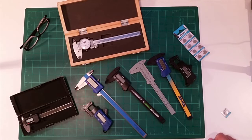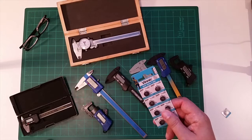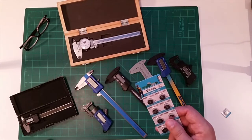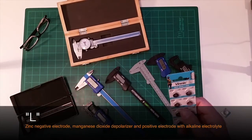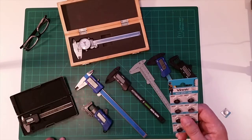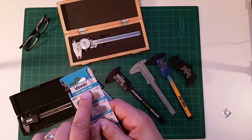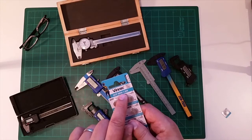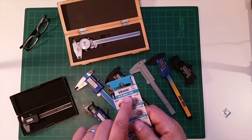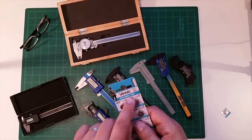I tried a different one — didn't work either. So I did a little research online, and there is a vast difference between the SR-44 and the LR-44. The 'L' in LR-44 stands for something related to alkaline — I'll put the Wikipedia link below. Long story short, they're an alkaline battery with a voltage of 1.5 volts. The SR-44, by contrast, has a voltage of 1.55 volts and an output of 200 milliampere-hours versus 150 for the LR-44.